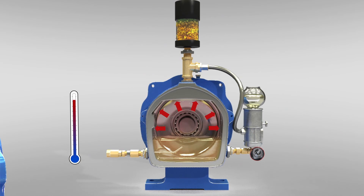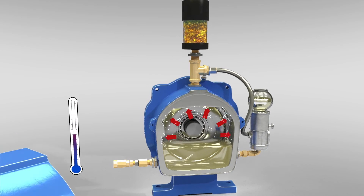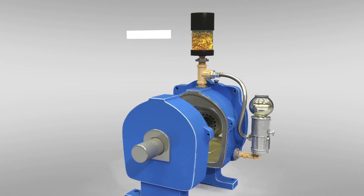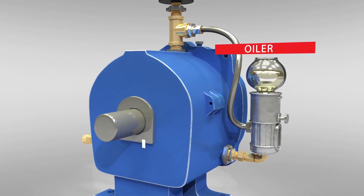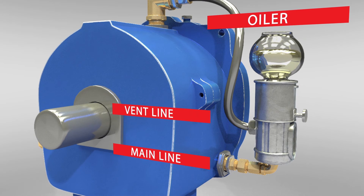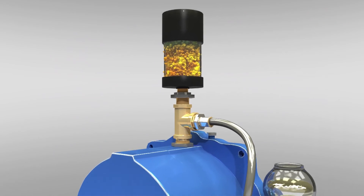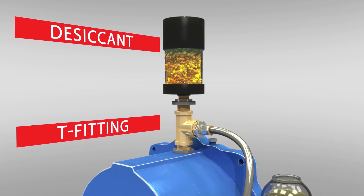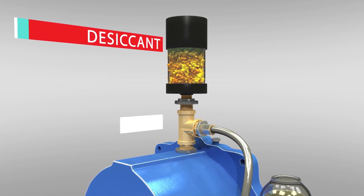The cooling of the system may cause condensation, so the addition of a desiccant will attract and disperse moisture from the system. The installation of the closed system is somewhat different in that the oiler has a main line as well as a vent line. The vent line gets attached to the expansion chamber and desiccant via a T-fitting someplace near the top of the equipment or the fill orifice if possible.